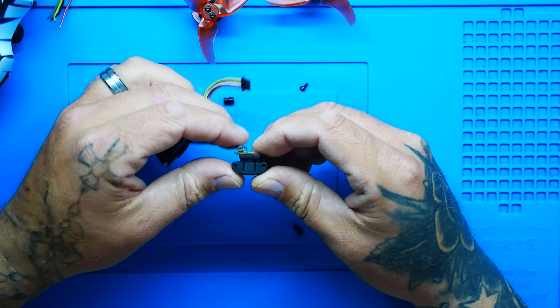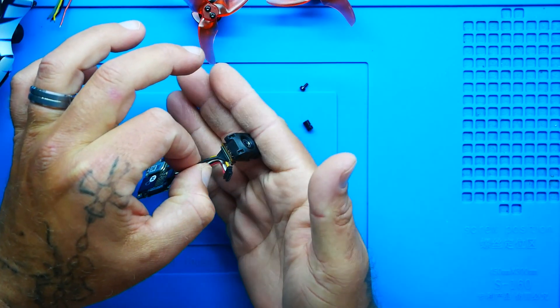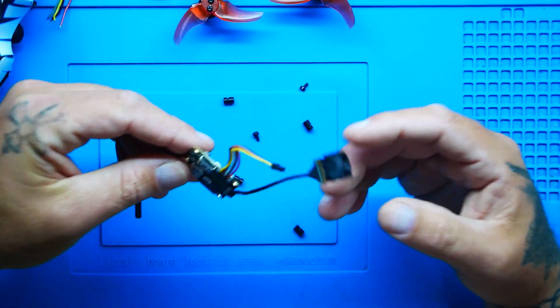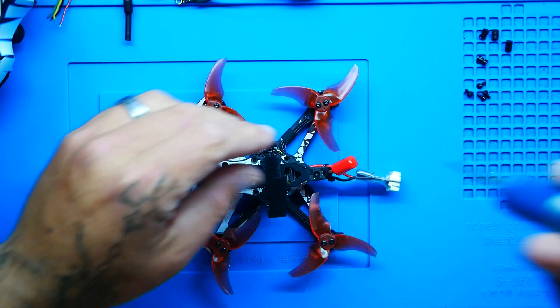I am running this micro — look how easy this is. That just fit like a glove. So that is now on and ready to be mounted. I have no idea yet how I'm going to make this work, and that's a barrier you'll face on yours as well unless you're doing the same one as me. This drone is not going to plug and play unless you're purchasing something built for DJI O4 Lite. You're going to need to get creative, snip wires, find the right pads, and solder it up. So I'm going to open up this battery strap and pull off the top plate.